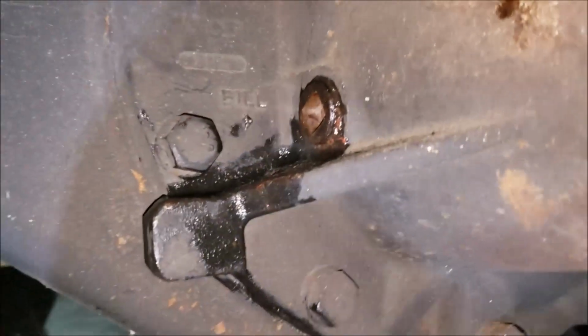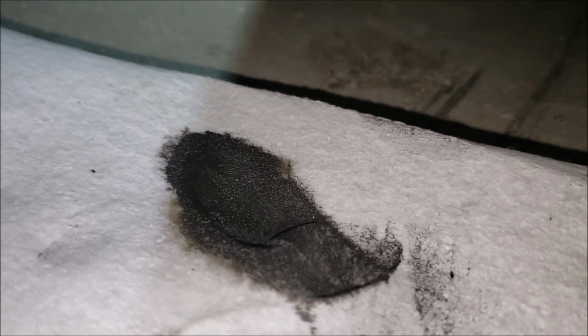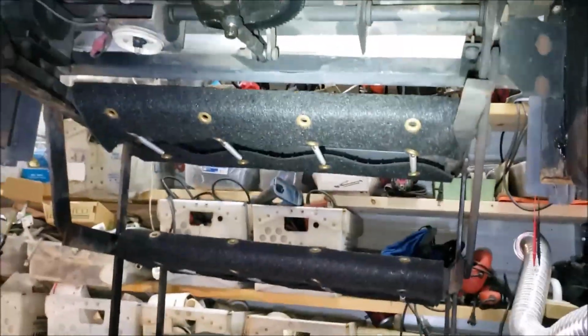And so I got my drain plug back in, got that done. I got my little sliver piece of metal. There's where I wiped off the magnet, which I expect to see that little fuzz and little particles. Wasn't expecting to see that. So it's not making me happy. One last thing I'm going to do on here, I guess I'm going to throw some grease on that step, and I'll be able to get up underneath this thing.